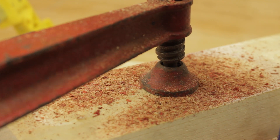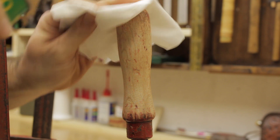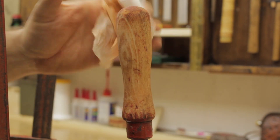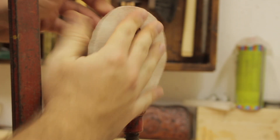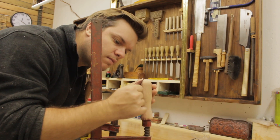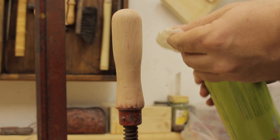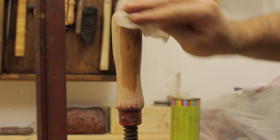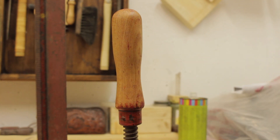I use the card scraper and a little bit of sandpaper. In between, I just clean off the excess paint or any lacquer that remains with a thinner — some people do it only with a thinner and that works as well. I'm sanding with 80 grit sandpaper and after that I apply linseed oil, which is the perfect protection. You can apply it whenever you feel it's too dry — just remove the excess so it doesn't slip again and it will stay great.